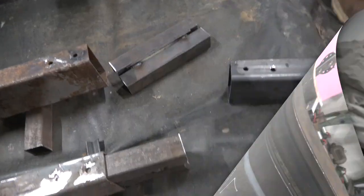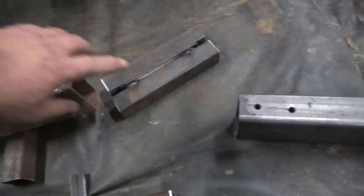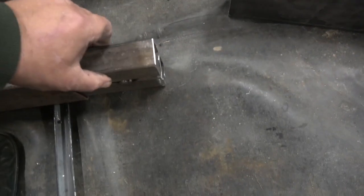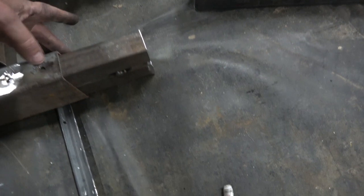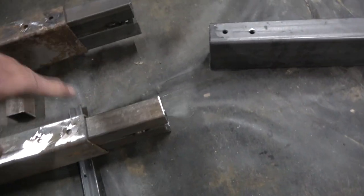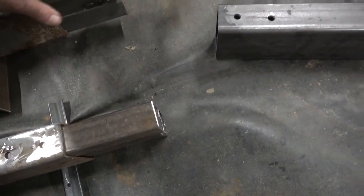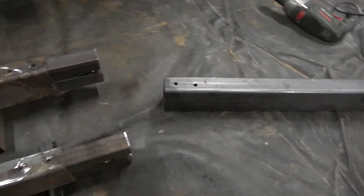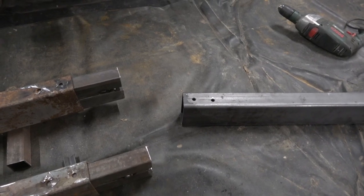Originally there were nuts welded on here to capture the internal part and stop it sliding. This is the piece I made up — I welded it and it slides inside there. It was slightly offset so one corner was over here and one on the other side, but this is actually a much better fit and it's absolutely straight. We've drilled holes in these, and then we'll do a complete butt weld all the way around and chamfer off the edges, which should extend it to exactly the length we need.